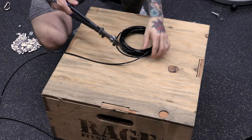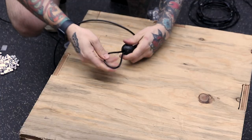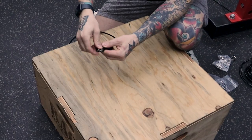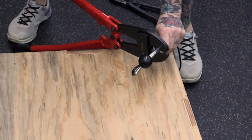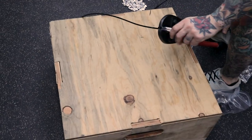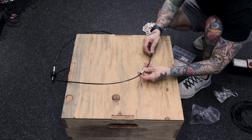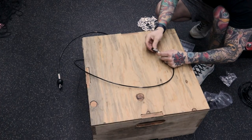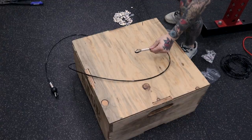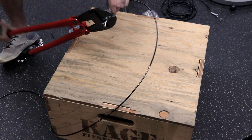The last thing you'll want is a rubber ball stopper. Start off by figuring out what length of cable you need, add 8 to 10 inches to account for the ends, and cut. Slide two ferrules on, then add the ball before making a loop and going back through. Add the thimble to the loop and get rid of as much slack as possible. Slide the ferrules back up making sure they're holding both sides of the cable, then use the crimping tool to lock the ferrules in place. I do three crimps per ferrule. Look how good that looks. I don't need a ball on this side, so it's just two ferrules and a thimble. When buying supplies, make sure you're getting the right ferrules for the wire and the right crimping tool for the ferrules. I'll link to the stuff I bought, but I'm pretty sure I overdid it on the crimping tool — it was $60, but you can probably get away with something in the $30 to $40 range. Some crimping tools are also able to cut wire, which is a plus.